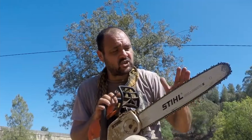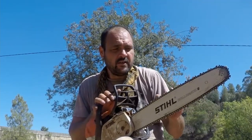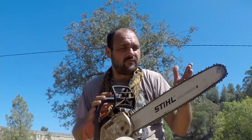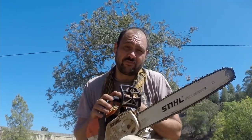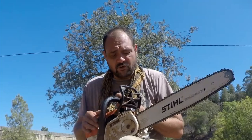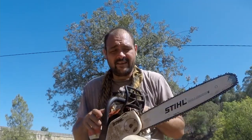Also, Stihl doesn't even make ripping chains. For those who don't know, ripping chain teeth are sharpened at 10 degrees instead of 30 or 35. There are variations where two teeth cut and two remove material, but Advoko Makes recommends having them all at 10 degrees, so that's what I've been doing. I had to make my own because Stihl doesn't make them, which tells you something — they don't really want you milling with a Stihl. Just make sure you use all these precautions and don't keep it full throttle the whole time, so you don't have to pay for an expensive lesson like I did.